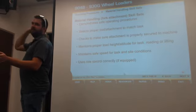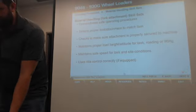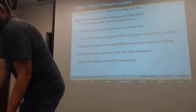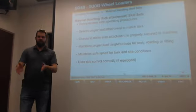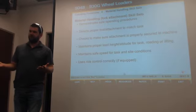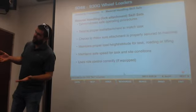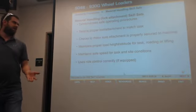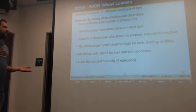If I try to pick something up off to the side rather than straight on, that's going to twist something — kind of the same concept on the loader. The load's not going to be evenly distributed front to back. When you lift up on something heavy, it's going to start moving the machine over to the side away from the counterweight. You could eventually tip the machine, spill your load — anything like that could happen.